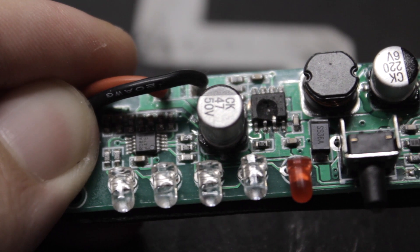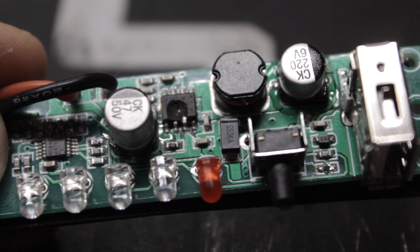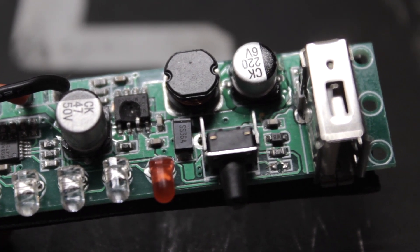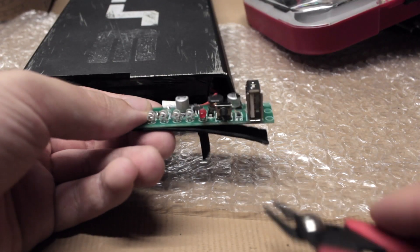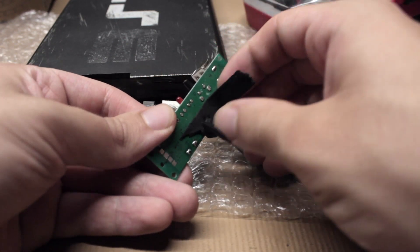The original charging circuit worked like this: you'd press the power button and the indicator lights would turn on, showing you how much charge you had left. Alongside that, the USB port would turn on too. It was a 5-volt, 1-amp charging port from what I remember. So those are our key design points: single push button for power, LED charge indicator lights, and a 5-volt, 1-amp USB port.